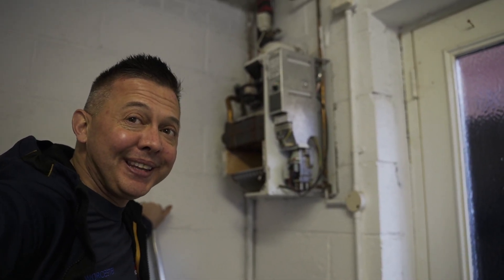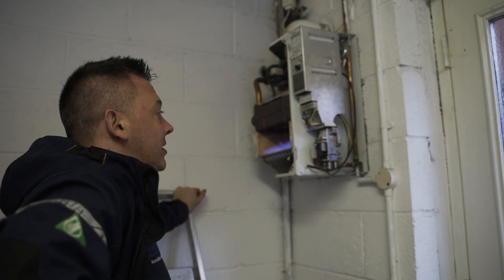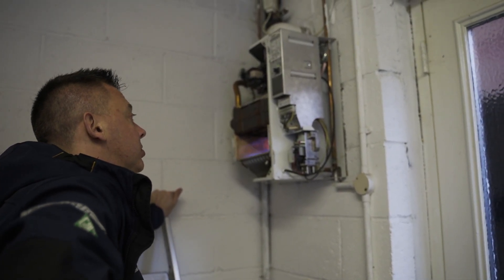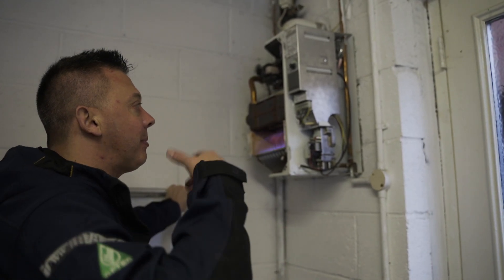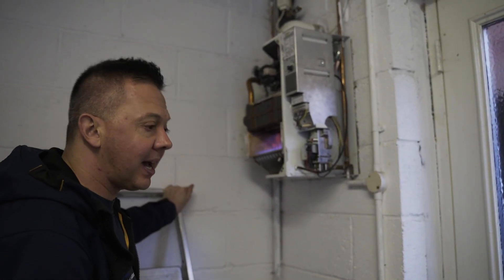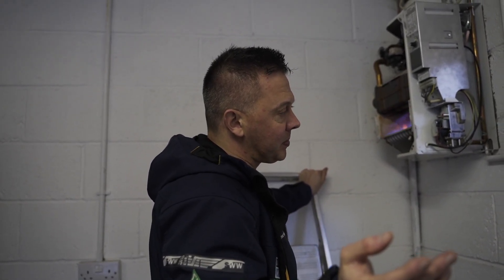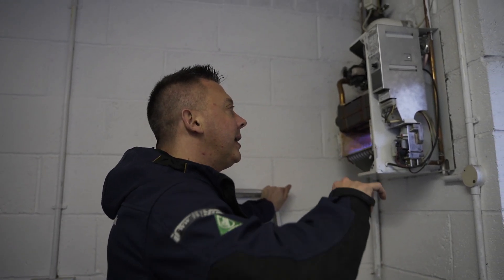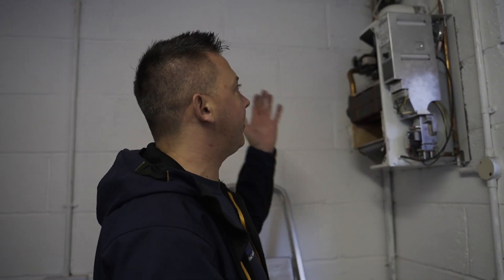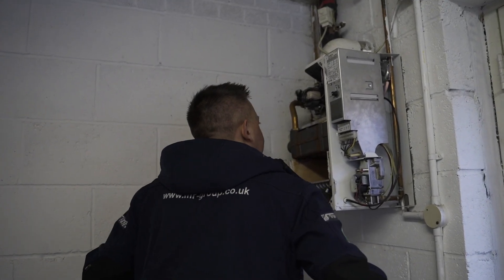It is that sensor - the high limit sensor - that's causing the issue. We've just proven it. If we can get one before Christmas... we can't legally leave that boiler. I need to let the boiler fire up while I'm here, check over it and see if the system gets warm. There's a reason why that's been triggered - probably either the TRV was done without switching the boiler off and it cooked, or when refilling the system the air wasn't bled out, which caused it to overheat. It's very dangerous for the boiler.